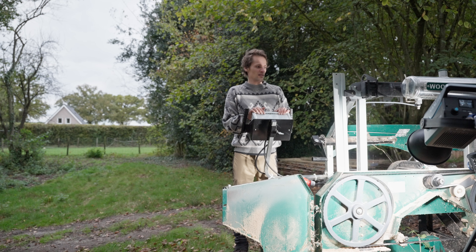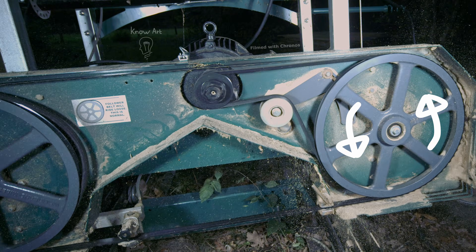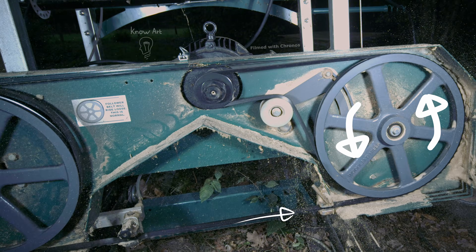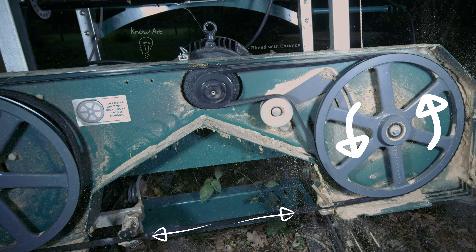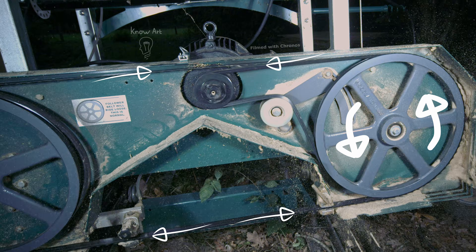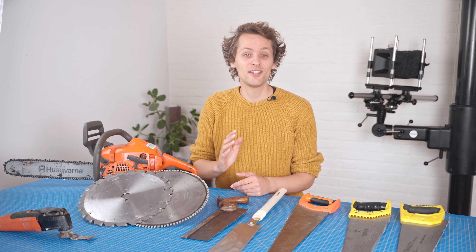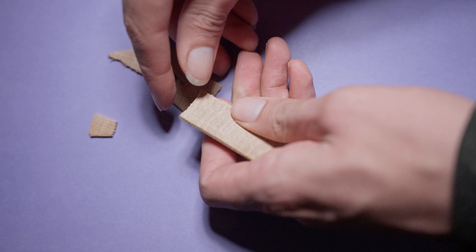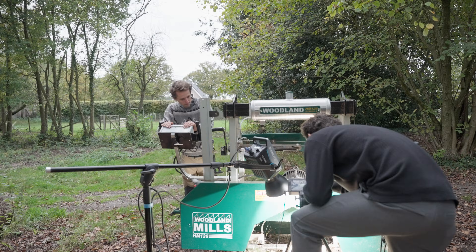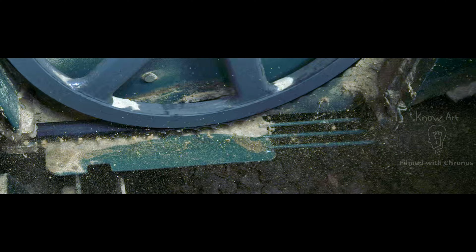When I start the machine, the top of the blade actually starts to wobble and vibrate, because the tension is lost on that part of the saw. This wheel starts to pull on the blade, and all the resistance from the cutting ends up stretching the saw out a little bit, and that slack ends up at the top. This saw makes dust and not chips — on a chainsaw, that's a clear sign your saw is dull, but not here, because we are ripping along the grain. Tiny, tiny pieces of wood break off instead of larger chips. In a full cut, you can also see that the gullets on this saw are finally filling up a little bit, and then the saw turns around while the sawdust just flies straight out of the port.